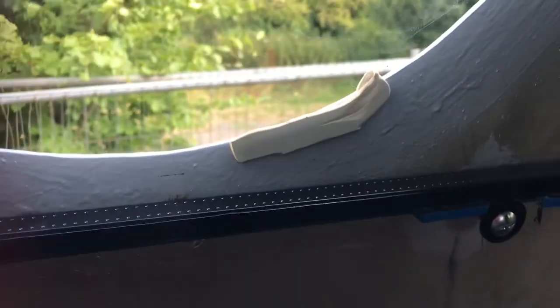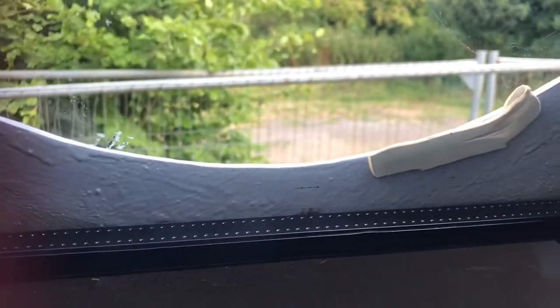The glass pack specs are: four millimetres of glass, a 16-millimetre space of argon gas, and then four millimetres of glass — so it just fits in snug and clamps up there. I haven't fitted these ones yet because I've got to wait seven days for the epoxy resin to finish curing before I can fit the windows.